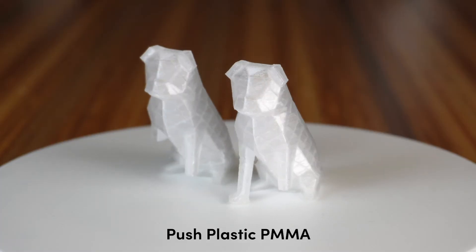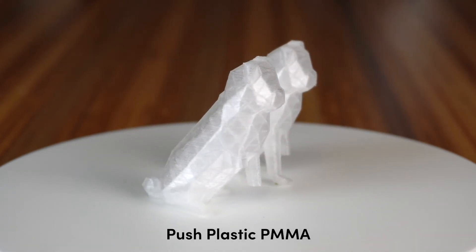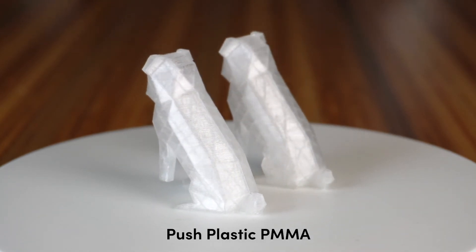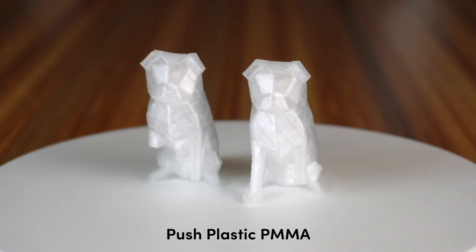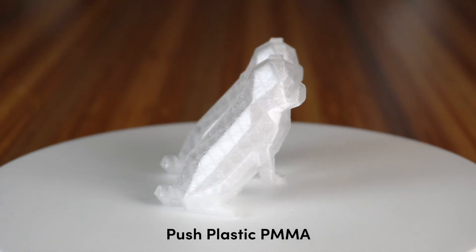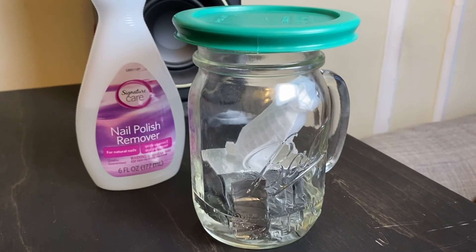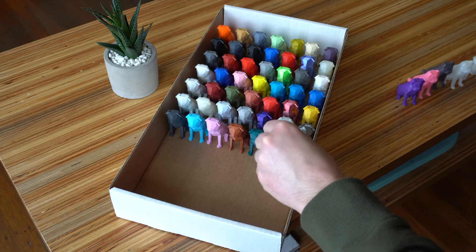Speaking of feet falling off, these are the best prints I managed to get with the PMMA filament. This stuff is just not that forgiving and I ran out of filament before I got it dialed in — I might not even be equipped with my printer to print this stuff that well. I tried the acetone smoothing technique on one of these — it's the one missing both its feet. I'm not sure what went wrong. It might've been the surface finish wasn't great due to moisture in the filament, or it might've been because I was using nail polish remover, which is mostly acetone but not pure acetone. Or I had it in a fairly narrow jar, which means the acetone didn't have much surface area to vaporize — if I'd used a wider tray maybe it would've worked better.